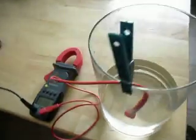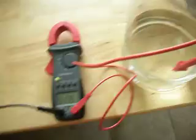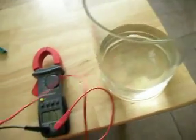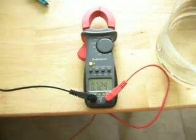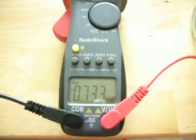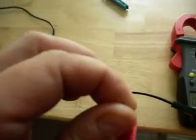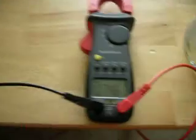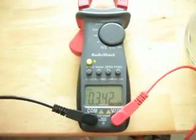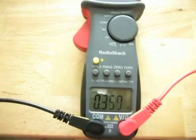This effect has me quite fascinated right now. I'm going to show you what the voltage is on the floor. I've just put my shoes back on and I'm going to pull this probe out. This is my AC voltage when I'm insulated — standing in my shoes, we have 732 millivolts. I'm holding the probe between my thumb and forefinger. So let's kick off the shoes and stand on the floor. Standing on the tile floor, we have 359 millivolts — quite different.